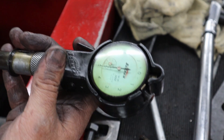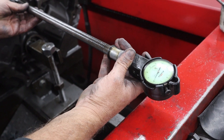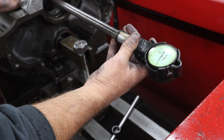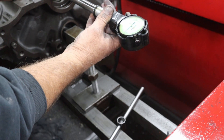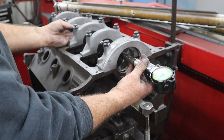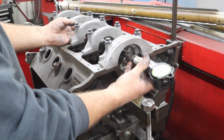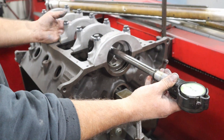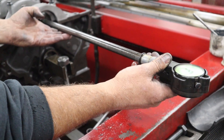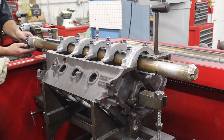I'm going to have about two thousandths come out — two thousandths on that one, real good. Two thousandths. Two thousandths. Three ten. That's good. Two thousandths. So we're shooting for zero. We have the gauge already set to our target number, which on this one we're shooting for 2.942 inches. They measure up to 2.942 and a half. We're going to set our stone pressure here.